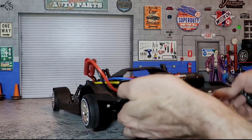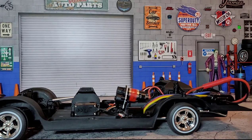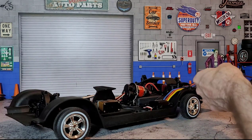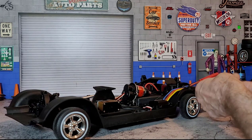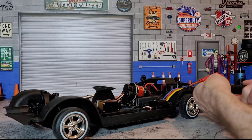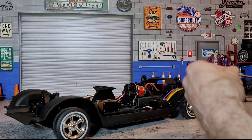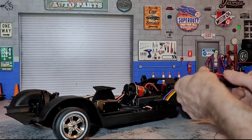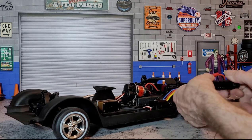Sorry, it's very important to take your time on the servos, because if you plug things in with one wrong setting in the wrong direction, too far one way, the switch in the wrong position, it'll try and force its way past the point it can't go, and it can smoke and burn out a servo in a minute. It can literally smoke and burn out a servo before you have time to grab the battery and unplug it.